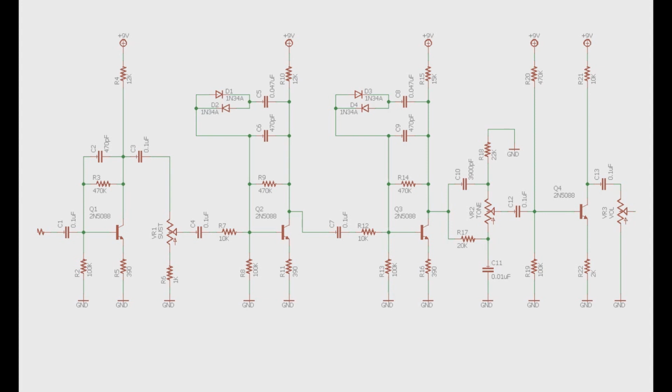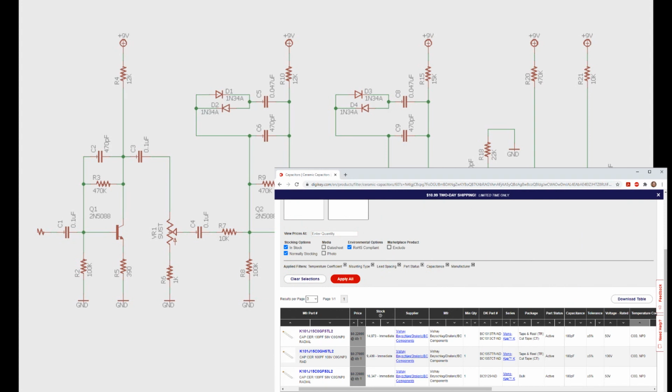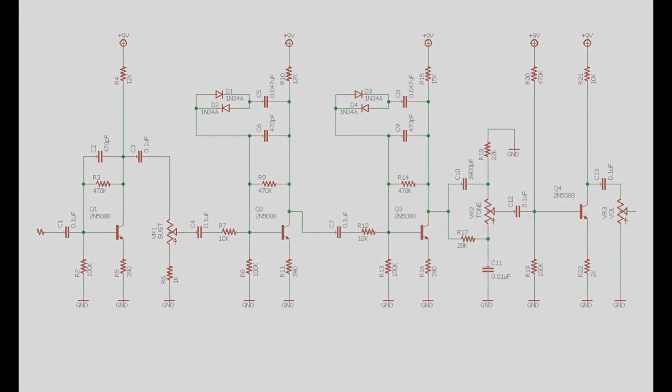To fix an issue like this, simply use other capacitor types like film, tantalum, or electrolytics. If you have to use ceramic, look for ones labeled soft termination or whose dielectric is C0G NP0, as they will reduce this issue drastically.